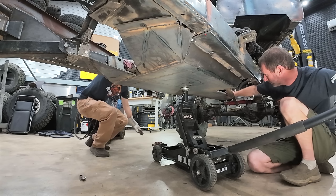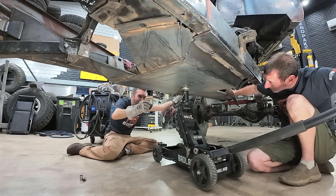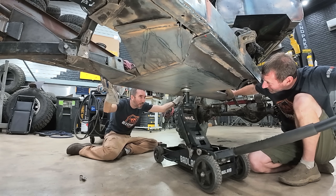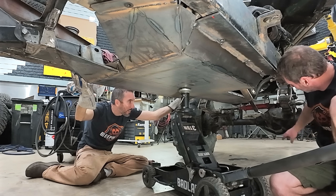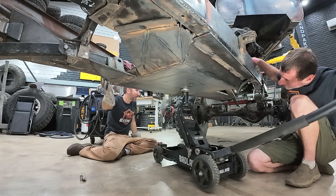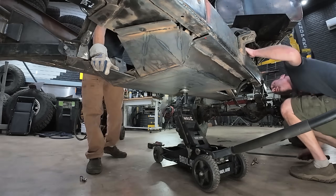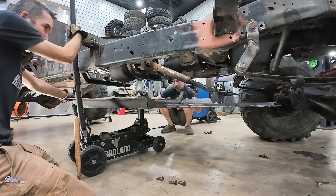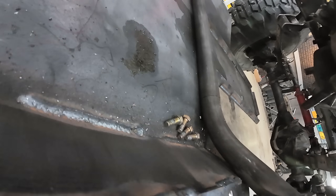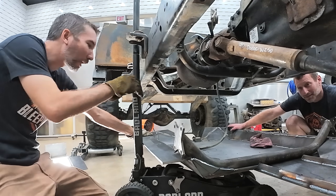Let's pull this thing. I made my best guess for where it's going to be balanced. Whenever we get it actually balanced, we need to put a mark on it — weld a circle and mark the balance point. Why is it still stuck? I bet it's tacked somewhere. So this accidentally got welded to it somehow right there — we'll just take a wheel and cut from this side. That is not supposed to be there — that was supposed to stay up there. I think we'll be able to lift it.